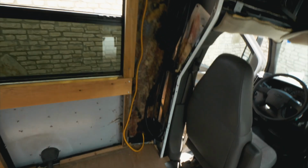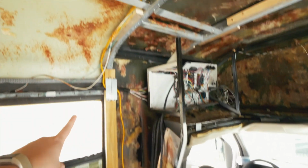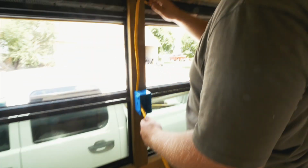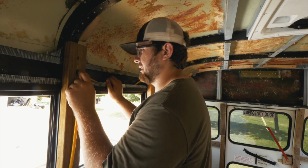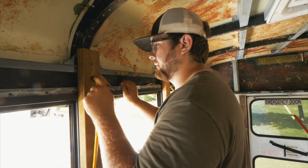So far, this is where the closet slash charging station is going to be. So we have that wired over to this outlet down here, and that's also going to be the fridge. Since they both won't be pulling too many amps at one time, they can be on the same circuit. And then this is just one of the kitchen plugs.